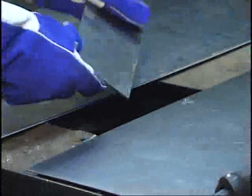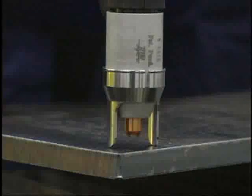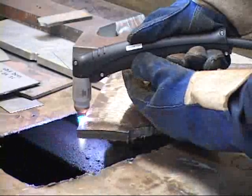Use a drag cutting technique, tip on work, for cutting one quarter inch material at 60 amps or less with a non-metallic straight edge. A standoff guide can be used for cutting above 60 amps, as well as the drag shield cup for some heavier applications.